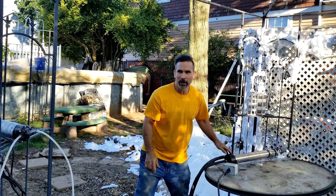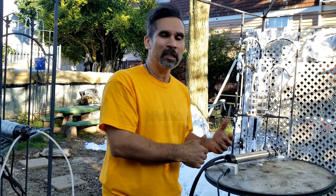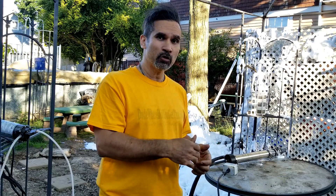This machine is great because if you're doing large jobs and you need to make a lot of air crete, this is perfect. You don't want to mess around with a small unit that's going to take forever to get a cement truck filled. If you're doing a large slab or air crete walls with a lot of cement, this is what you want. A cement truck will come, you put the hose in, and with the computer you can calculate how long to leave the foam machine pumping foam into the truck to get whatever compressive strength you're looking for.